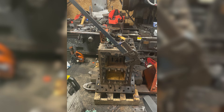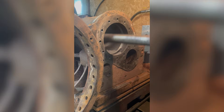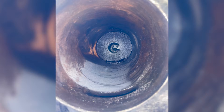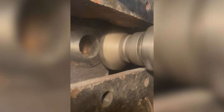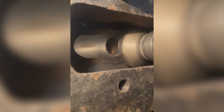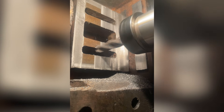This is where the work begins at my place now. The cylinder block had a turn on the boring machine and it took about 2mm out of the bore to clean it up — it was quite worn. So it's had a bore and a hone on the high and low pressure pistons. That's the register face being machined, and that's the valve face on the block being machined.